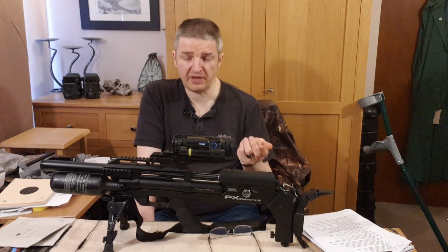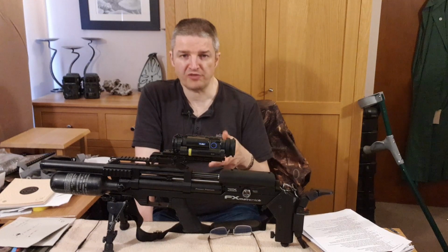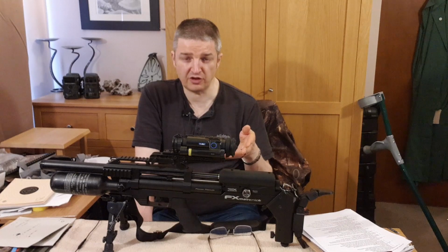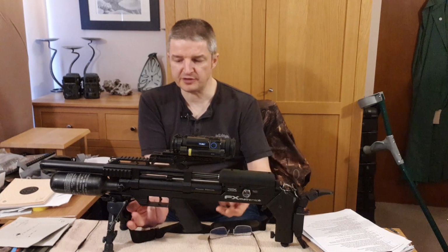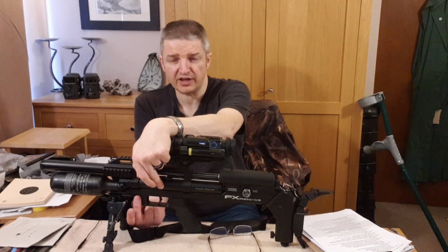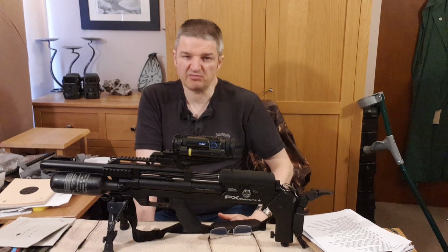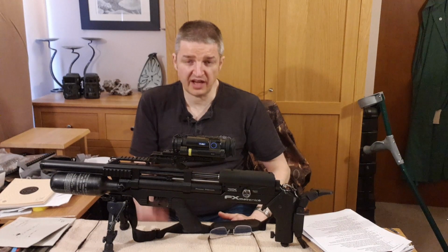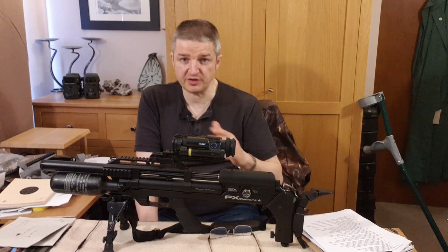And as you'll see from Matt Dubber's video, you have to start upping reg 1 if you want to raise reg 2 pressure significantly, for example, to go onto higher power for slugs, because you need approximately 35 bar pressure difference between reg 1 and reg 2. Certainly between 20 and 70. So they talk about 35, but between 20 and 70. And when you get to the higher power levels, you're obviously going to need to raise reg 1. So there's a difference between the two regs.